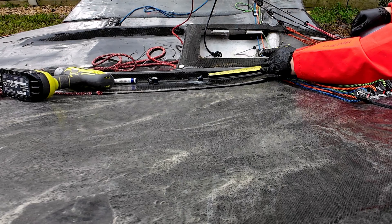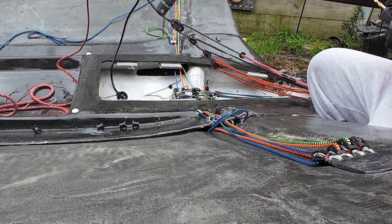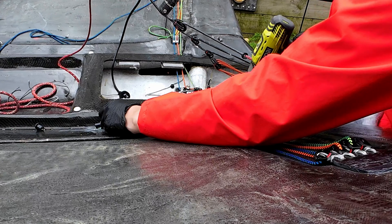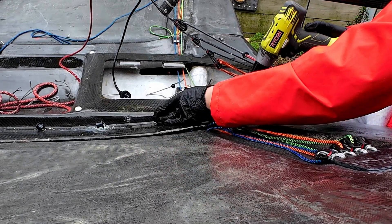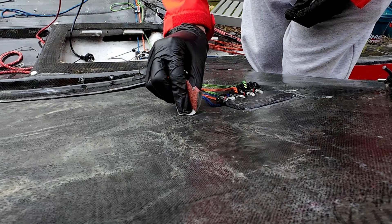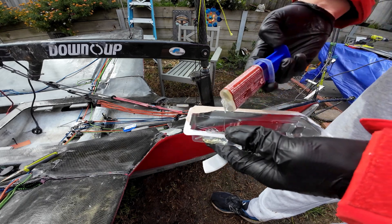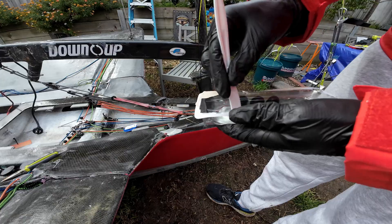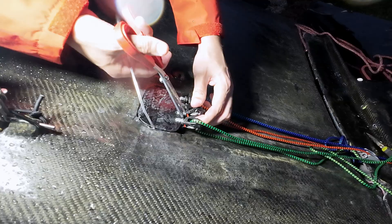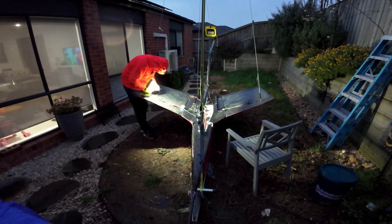I'm installing some little stainless-lined fairleads so I could run the ride height adjuster separately from the other systems, because it's like a continuous loop. I got my step drill bit, shoved some holes in the foam, and epoxied the fairleads in. A friend had some stick-on padeyes left over from when he was running a TP52, and I was able to glue them onto the wings easily, then lash a little block onto those for the continuous loop of the ride height adjuster. I used genuine Araldite this time because it goes off quicker. Because I had the stick-on padeye for the ride height adjuster, I didn't need a fourth block I'd lashed to a carbon plate, so I cut that one off - which also gave me enough space to get my hand in to adjust the vang. Win-win.